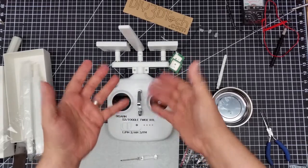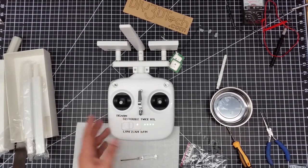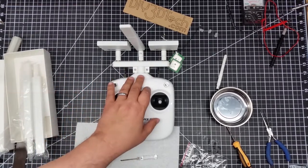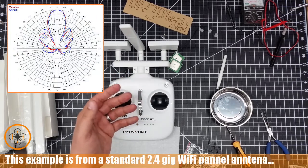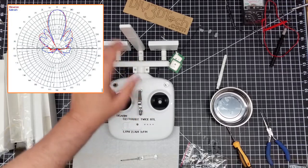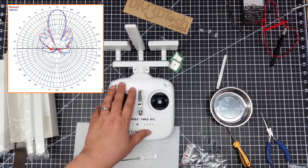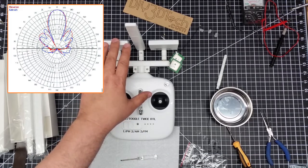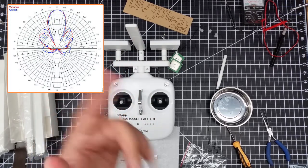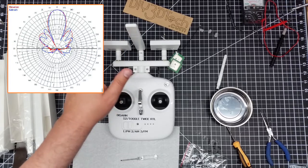We've now got the ARG Tech range extender set up on the Phantom 3. Turning this on — everything seems to be working, power is good, all the cables are hooked up right. Now, one brief thing: I wish I could see some propagation maps. When you design or measure antennas, you typically use what's called a polar propagation map, which shows how the radiated effect of the antenna is in a polar plane. I'm guessing these panel antennas are going to have about a 60-degree cone — just a wild guess on my part. If I'm wrong and you know for sure, let me know in the comments below.